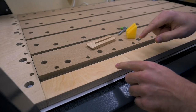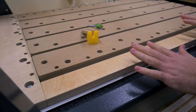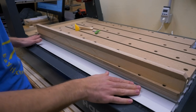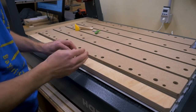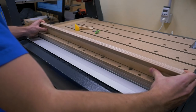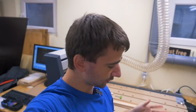Another addition was adding this strip of wood here, which adds support for the stair ramps when I'm using my hold-downs in the threaded insert holes. I stuck that down with double-sided tape, but unfortunately it didn't quite hold. The reason the tape failed, I guess, is because of temperature — this aluminum table is pretty cold, much colder than the air temperature. The wood got cold on the underside and wanted to shrink, but the top surface didn't, so the wood started to bend. The tape failed in the middle while the sides were still stuck. Lesson learned — just screw it down.